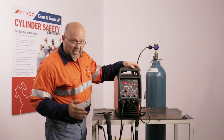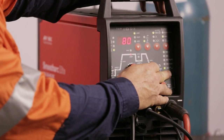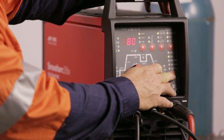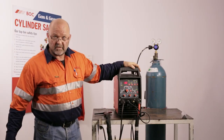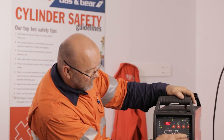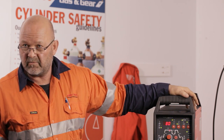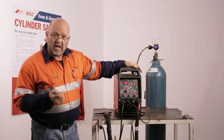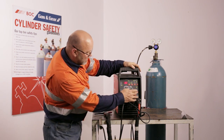Over here we've got a polarity switch, so now we can talk about running AC in three modes: AC sine wave, AC square wave, and trapezoidal. There are three waves you can use to deliver your AC waveform. If you're in DC, you've got DC negative on TIG — as we know, TIG runs on DC negative — but you can also run positive on your stick electrode welding. So we're going to go down to square wave.